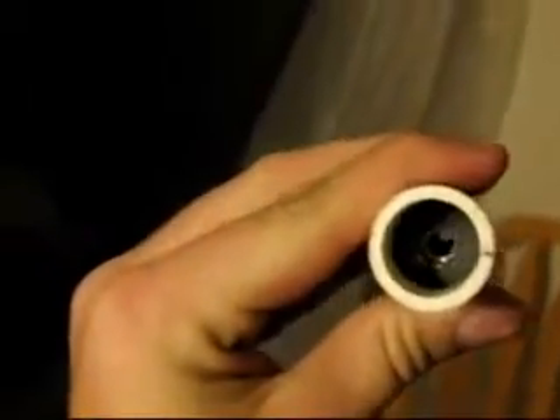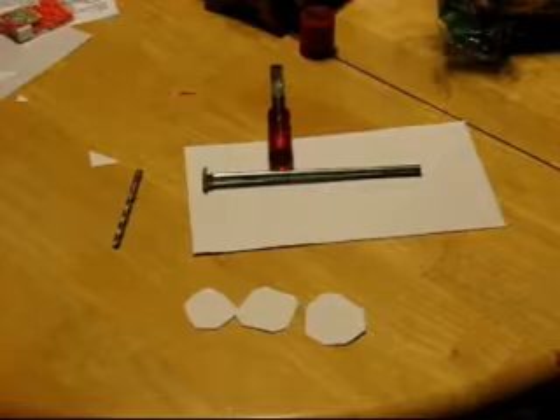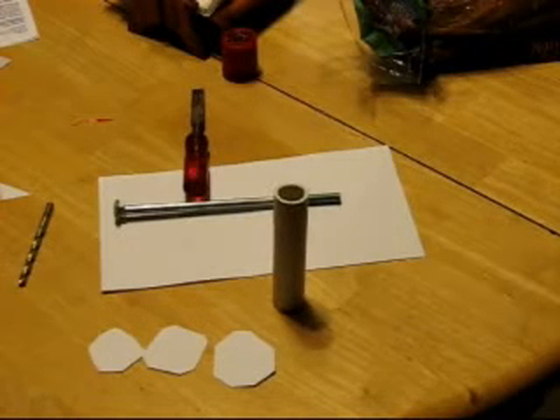Now here's the tricky part. You can see that's my top grain inserted — I'd say roughly three centimeters to work with. This is going to be the forward closure. This is going to have to seal off the top of the engine from all the pressure and it can't leak at all. What I use to seal this off is a five-minute epoxy. However, I cannot have the epoxy touch the surface of the propellant, and I can't have the epoxy dribble down into the core. So I have to seal off the top somehow.